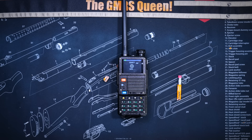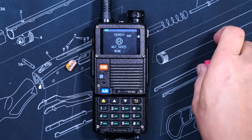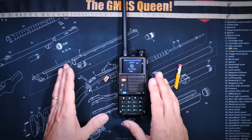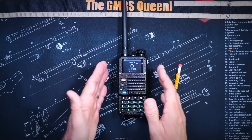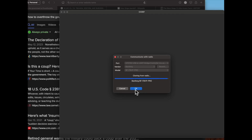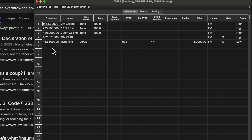The radio has a frequency scan feature which will display the frequency and any tones being used by any radios nearby — and by nearby, I mean within around 75 feet or so for another handheld radio and a few hundred feet or so for more high-powered mobile or base station radios. And yes, this radio is CHIRP compatible. However, you will need a PC03 programming cable, which is not included. That cable costs about $22. Affiliate link below.